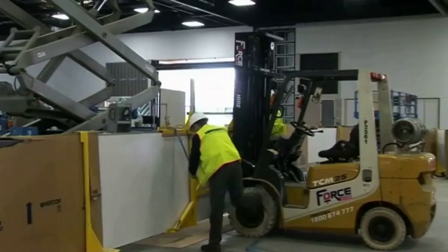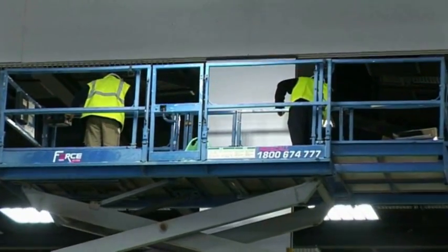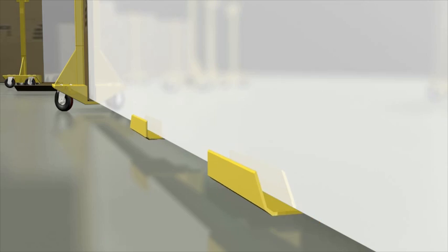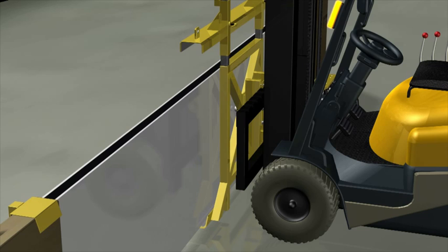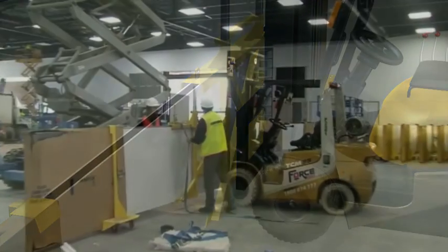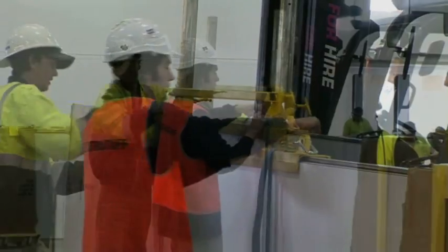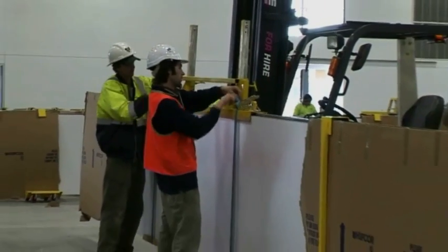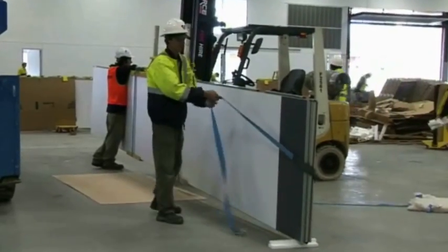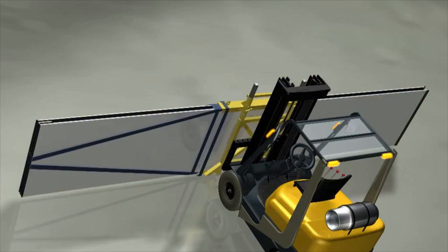A five-person crew is needed: two on the floor, two working aloft, and one in the forklift. Position the panel over the fixed rail of the lifter and lift on the fork to take the weight of the panel. Move the sliding rail down onto the top of the panel and lock off. Secure the two ratchet straps around the panel's width and tighten. Tie off excess strap and clear away any remaining packaging and the trolleys. Secure the remaining two ratchet straps down through the centre of the bottom rail and back up the opposite side of the panel. Tighten off the ratchet.